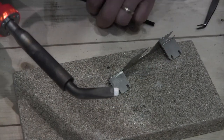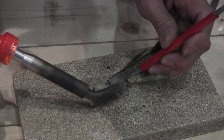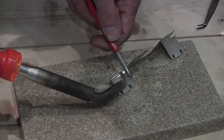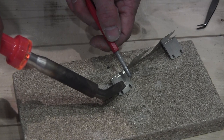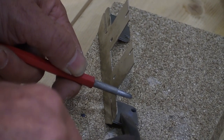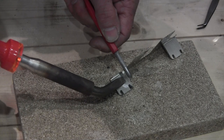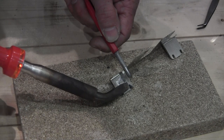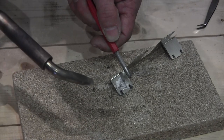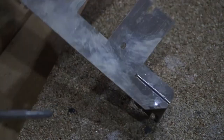and then what I'll need to do, you don't have to do this, but it helps, is put a bit of flux on the back of the joint, really so that I can get some solder flowing from the iron onto the piece of work. That will have to be cleaned up later, but it helps amazingly with the heat transfer. So it helps get heat into the work. And then literally, all I'm doing is holding the iron onto the back here, and it's spitting and popping. But I know that as the two pieces of sheet come up to temperature, the solder's melting, and it's going to join those two together. Okay, I'm just going to leave that now to fuse. And there we are, done.